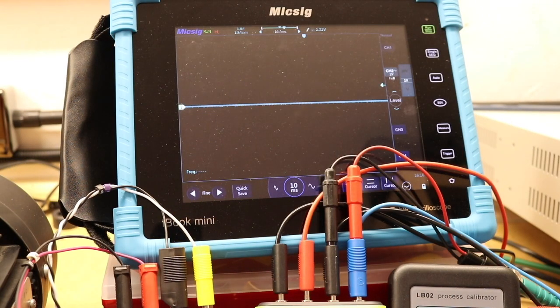The whole object of this test is to verify that the 4 to 20 milliamp signal injected by the SG-003A reappears on the LB02 as exactly the same milliamp signal if everything is working correctly.